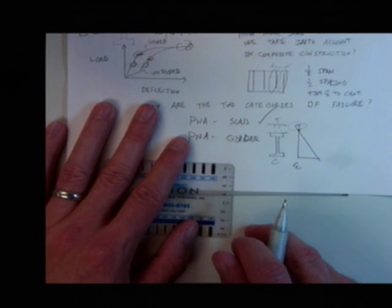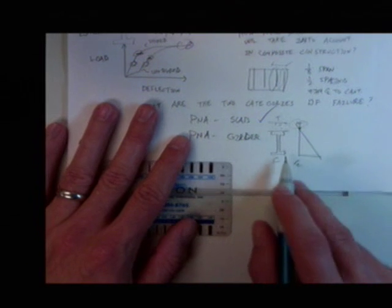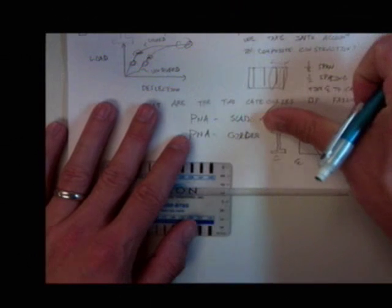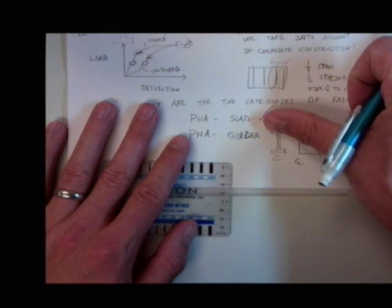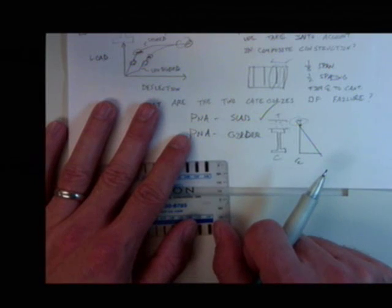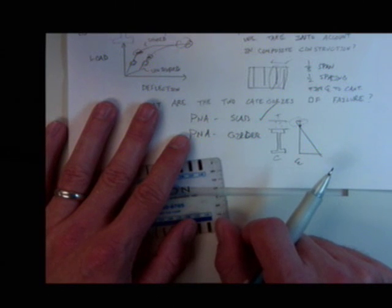It'll change your answer by about 3 to 5%. I have done the math. Okay. My question, though, is how do you design the situation? But you would act like there is no steel deck, there is no deck on top. Can you still rely on the dead weight in the slab? Yeah, but for what? Just to hold you down? Yeah, just counterbalance it. But dead weight, you're going to find in your life, it's rare when it helps you. I'm not saying it won't ever save you, but pretty much ignore it.